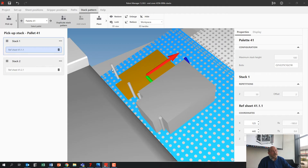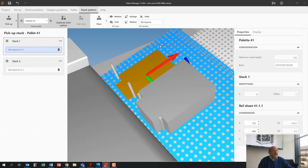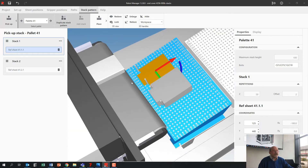We're checking collision with these pins — first the parts against the pins, but also the robot against the pins. If you put everything full of pins, the robot cannot get to the last sheets on the stack anymore. We simulate and make the program in the way you've put the stacks down: first one, second one, third one. You cannot start in this corner because everything would be full with parts — it doesn't work. This order is okay.